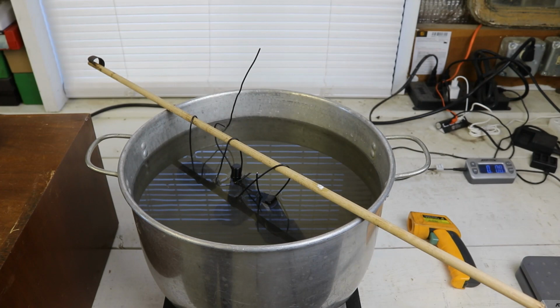And so we typically, if we've got big parts, like a barreled receiver where the barrel's screwed into the receiver, we would do that in a bluing tank. But all we had was some small parts here, so we just set it on a hot plate here and got us a witch's brew going of neutralizer. And we'll let these go at about 130 degrees or so for about 45 minutes just to neutralize those salts.